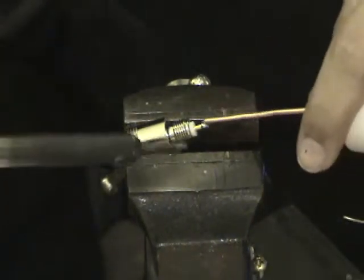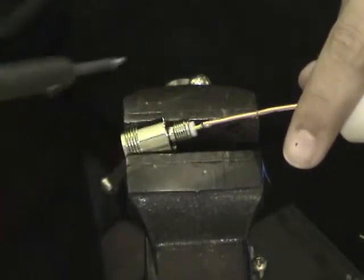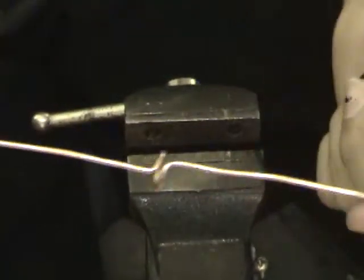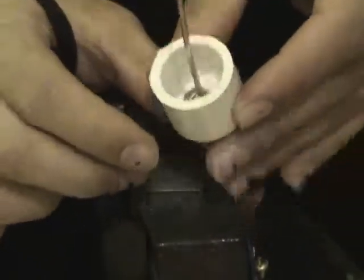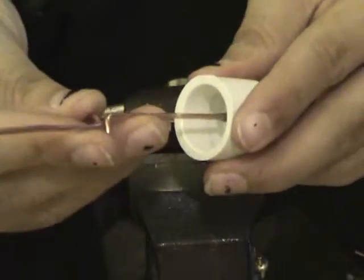Then we're just going to take the two pieces, butt them up together, and force them to join. The antenna is now nicely affixed. I'm going to wait for the wire to cool down a little bit, then assemble the rest. I've already drilled a hole — we've inserted the connector like so, and now it's just a matter of taking some needle-nose pliers, getting that nut into place, and twisting this on. That's nice and twisted on, nice and sturdy and stable. After some last-minute adjustments, slip this into the pipe and there we go — Compact Collinear.